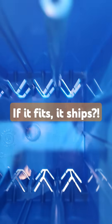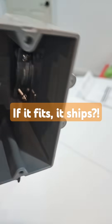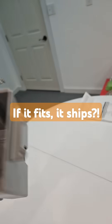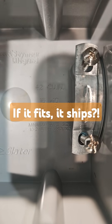I thought I was doing good just getting the cubic inches right. He mentioned a box like this one, which actually has a clamp that's made for 8-3 and 6-3. And lo and behold, when you check the back of the box, it's rated for up to 8 number 6s.